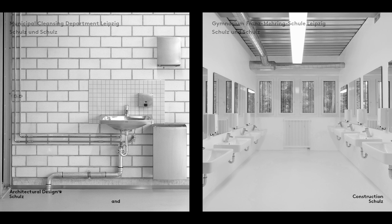On the left, you can see an exposed installation in which the pipes and wash basins are arranged to match the brick bond. In the example on the right, all the water supply and wastewater pipes for the wash basins are concealed in the walls and so invisible. This is only possible with plasterboard walls or facing that have a cavity in which the cables and pipes can be hidden. In residential properties, concealed installation is the norm.